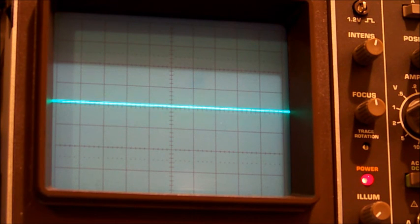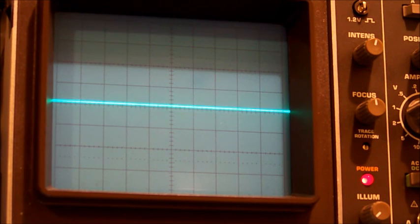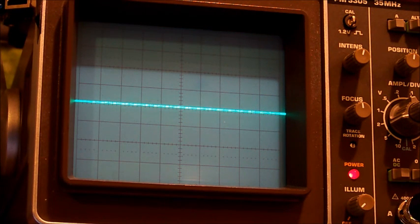Now if I have a look at pin 1, it's sitting at 3 volts DC. Let's just have a look. Just going to check the voltage on this IC. And we have just over 8 volts. I'm picking that'll be off that earlier 8 volt line that we referenced at 8.5. By the time it makes it over to that IC, it may go through a diode. Here we are. Half a volt drop along the way somewhere.